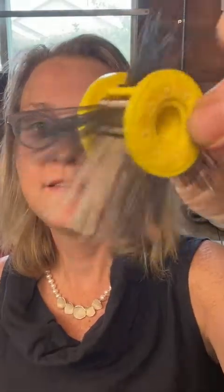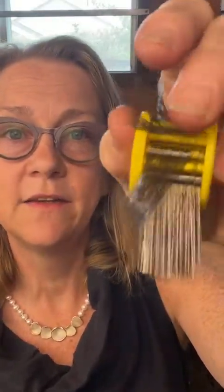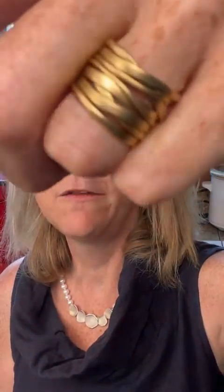And another thing I sometimes use in terms of the polishing wheel is this crazy thing. These are individual tiny little steel spikes that I put on my polishing wheel instead of the polishing wheel on the spindle. What it will do is make this kind of brushed finish, because the individual pieces of steel will hit the gold and basically mar it, but so many of them that it looks like this matte finish, which is very beautiful, and I'm very fond of.